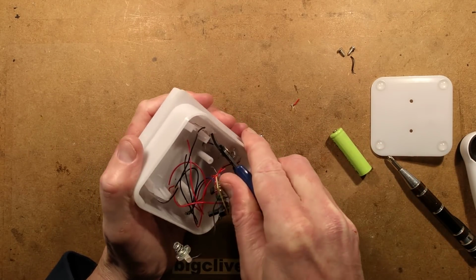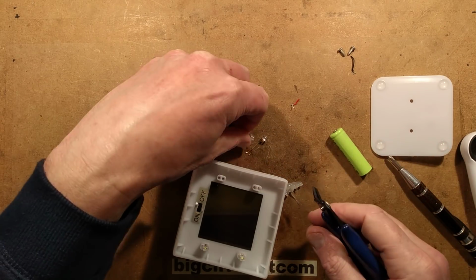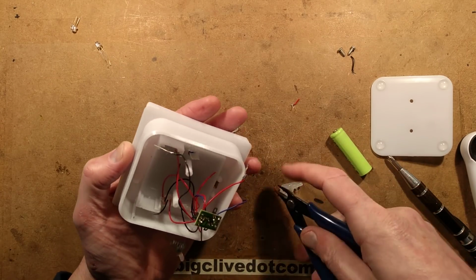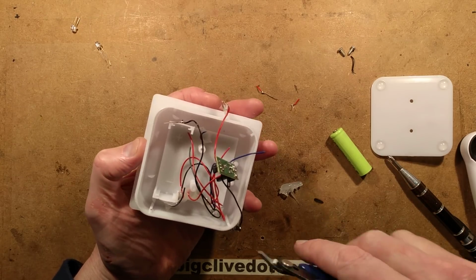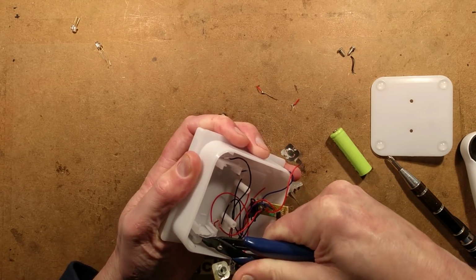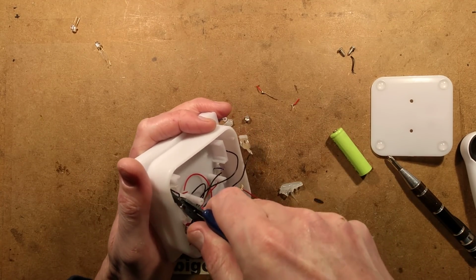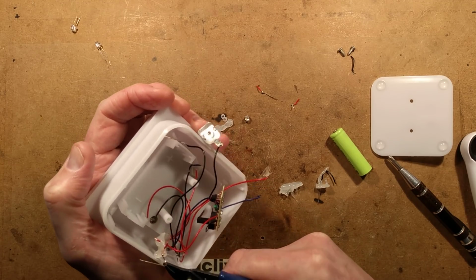What I was saying there about the nickel metal hydride cell, by default, you can trickle charge it continuously at low level and it won't harm it. I mean, it does. If you trickle charge it continuously all the time, it does impact on the life, because it's engaging a sort of chemical reaction inside that, when it reaches full charge, the battery liberates gas inside, but then it's reconverted back into the electrolyte from the gas, so the pressure doesn't build up inside. If you try charging it too fast, it would potentially build pressure up, and that risks a battery exploding. That is why when you try charging an alkaline battery, sometimes they go bang. If you put an alkaline battery in a standard nickel metal hydride charger, it can be quite a destructive experience.